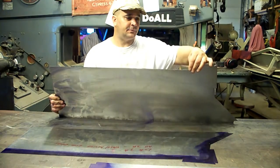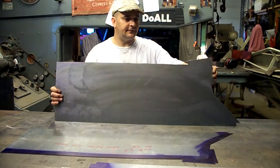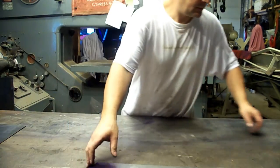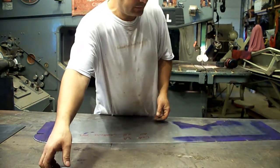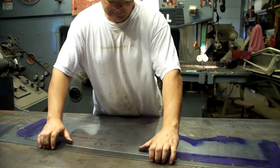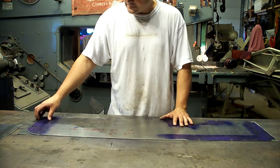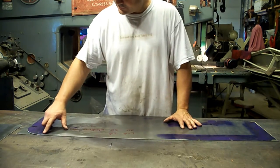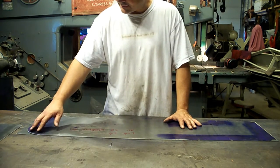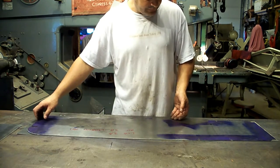Here's our piece cut out and deburred. We've got to do a little bending on this area, but we'll get that after the top piece is made. We'll stick that with our pattern and put it off to the side for now. I'm going to do the same thing — grab a blank and do the same thing to the top that I did on the side. We'll get that laid out, cut, and then start laying out the beads. This area over here on the corner and this whole section we're going to run on the flanger so we can get around that corner real nice. This section's easy — we can do it in the brake.